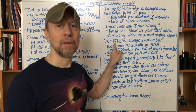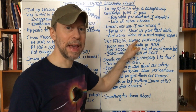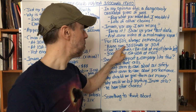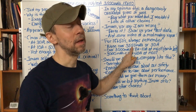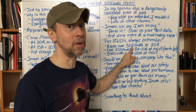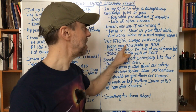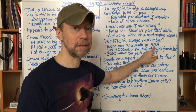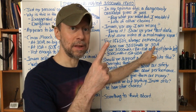Folks, for 18650s, for all of them, remember, these are some tips on what is an exaggerated rating and what's not. There are no 18650s over 3550 milliamp hours, often rounded up to 3600, and that's the Panasonic 18650G. That's the only one that high. I don't think anyone rewraps that. That's an expensive cell. There are none rated over 30 amps. None. No 18650 is rated over 30 amps, and only one of them is rated at 30.